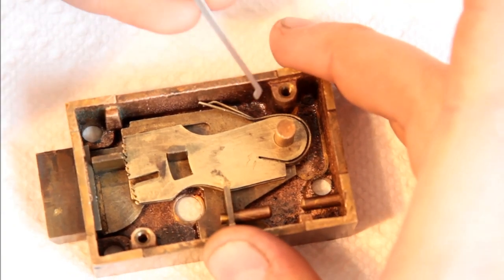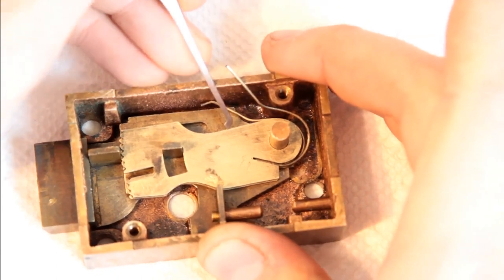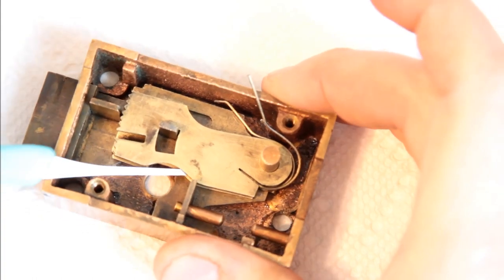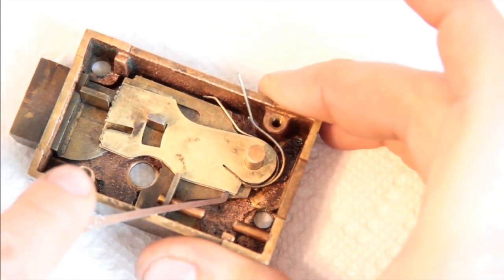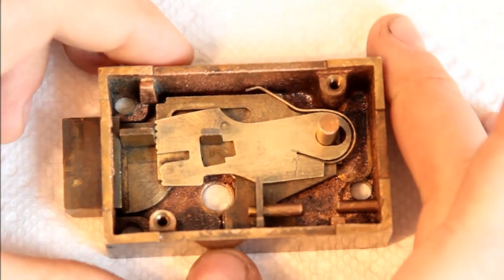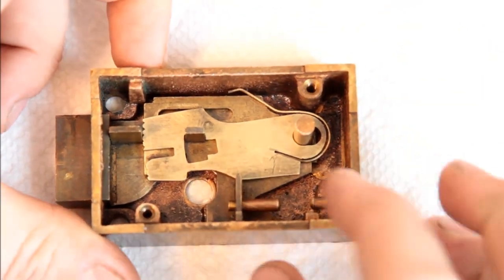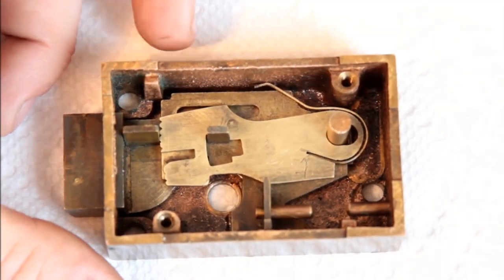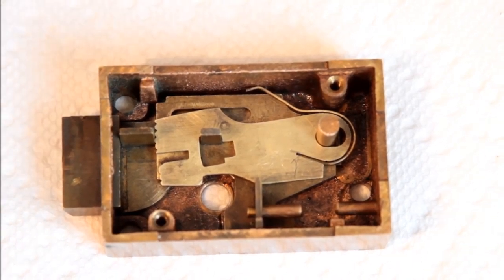Here's how this works. The special lever would normally — when I got this — be at the top of the pack, but I'm going to demonstrate it with just two levers in, positioned so you can see what's going on. I don't have to try to manipulate six or five levers. I've removed one of the levers. This special lever, which I'll call the guard lever, was at the top of the pack when I got this lock — I've put it here for demonstration purposes so it'll be easier to show you what's going on.